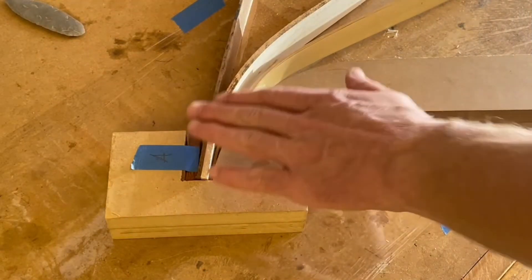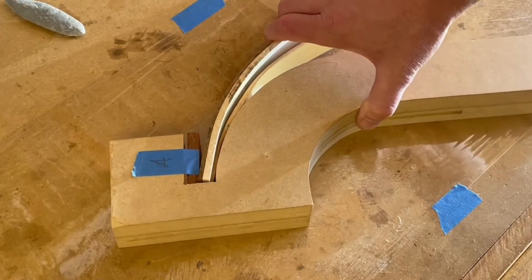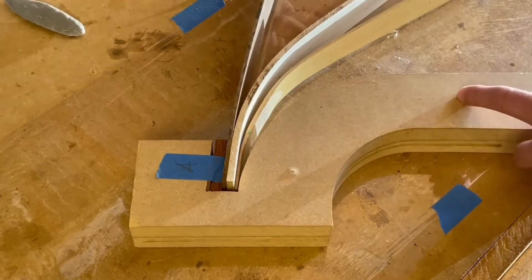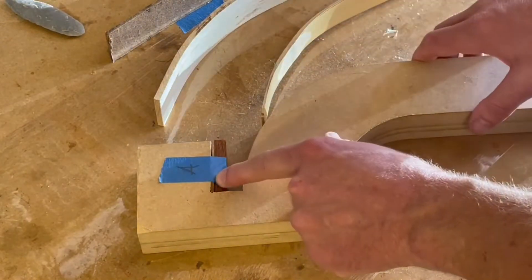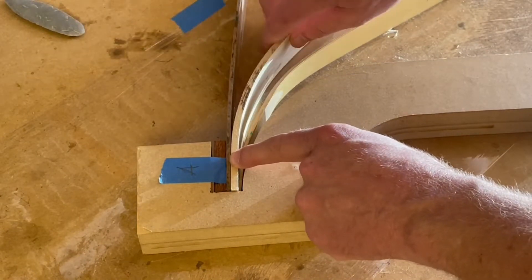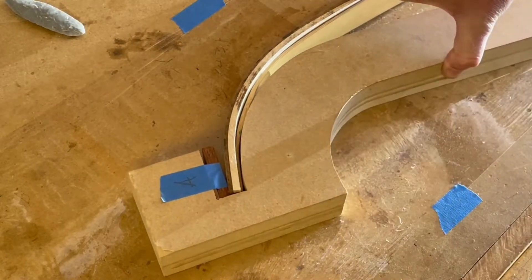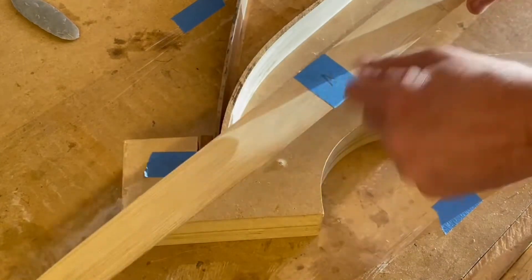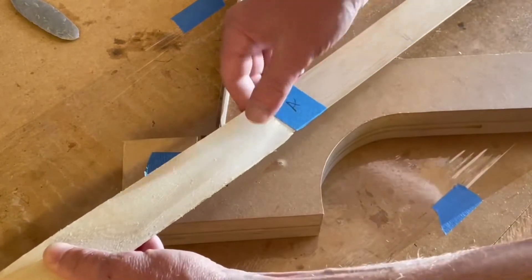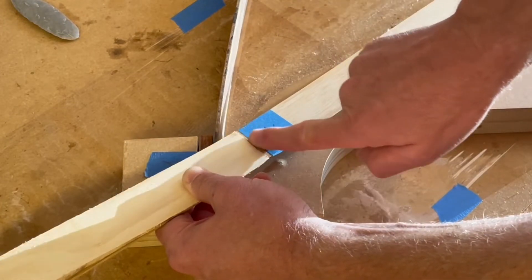Here are all the parts put into the mold and I'm going to glue them up on edge so everything glues up just right on the bench top here. To help smooth the way, this particular piece here is just a piece of masonite that's going to help bend over the top of our hackberry wedge and put it to our bamboo backing. I've sorted out just how much space I need to accomplish that operation and then taped in the spacers required to get a good fit.